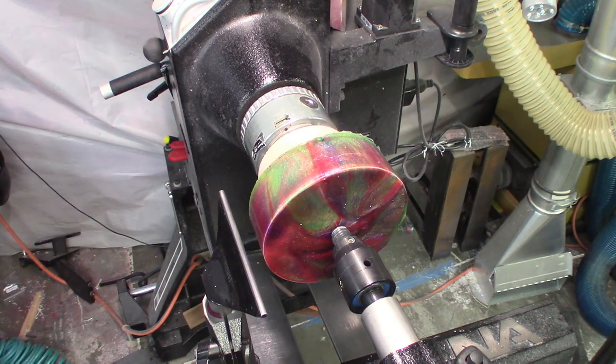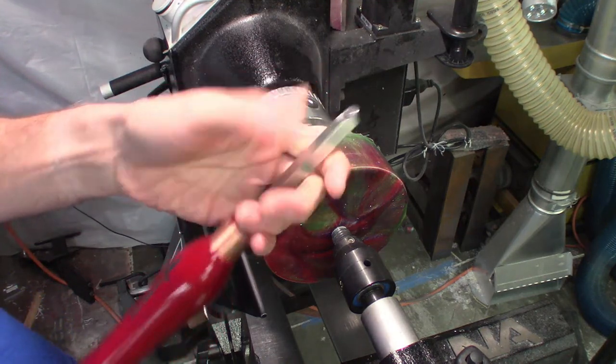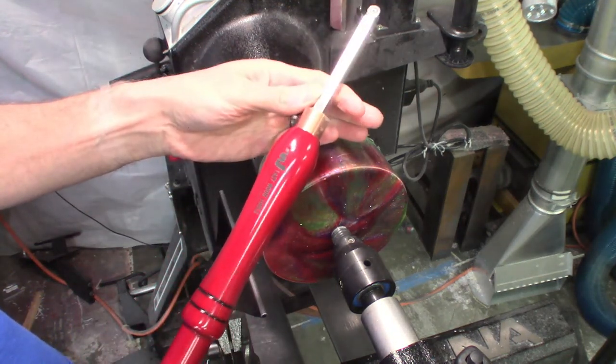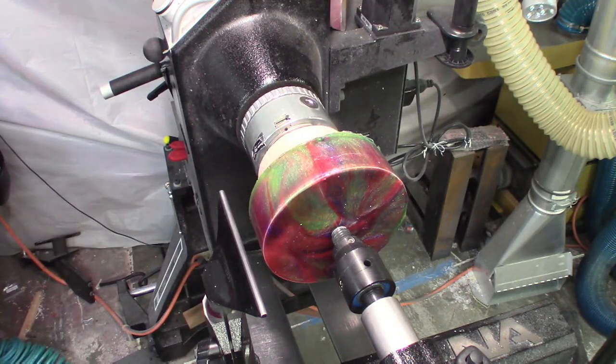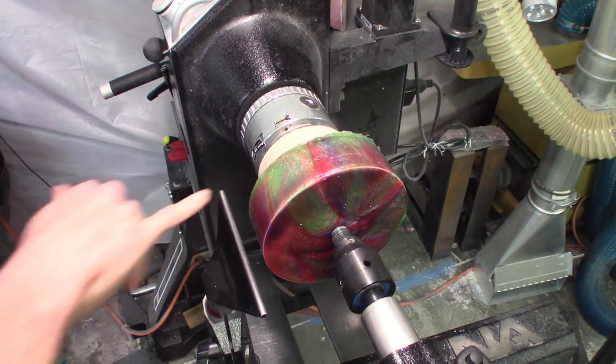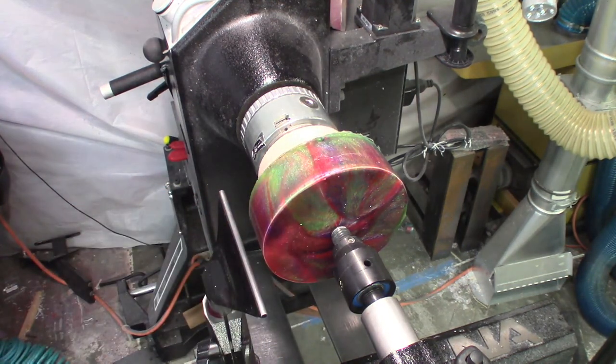All right, so I'm just gonna use the Easy Wood tools. I use this for almost everything. The CI3, or it's the mini finisher, to just kind of true everything up. Probably switch over to a square bit so that I can come in and put a little chamfer on the bottom here. And then we'll just true up the face and everything will be good to go.